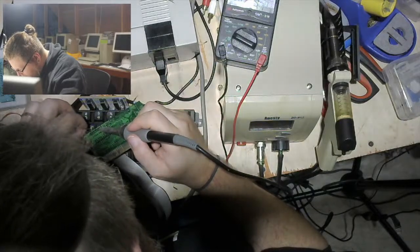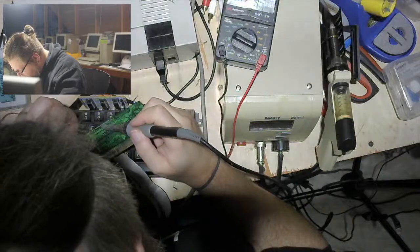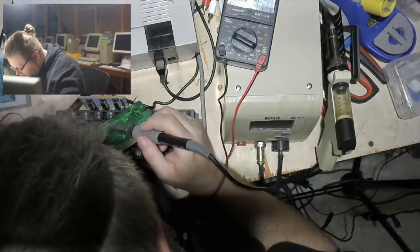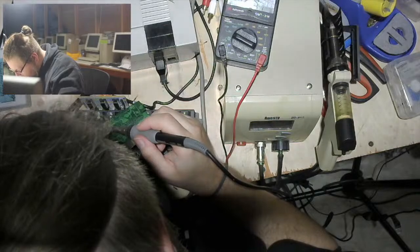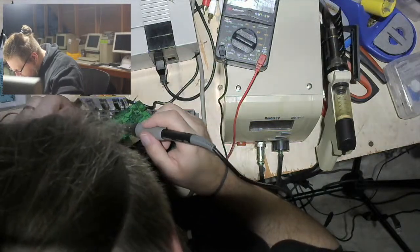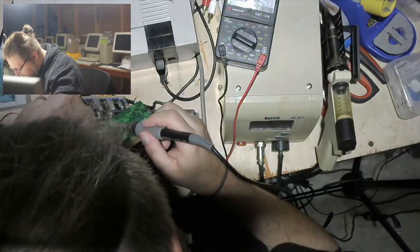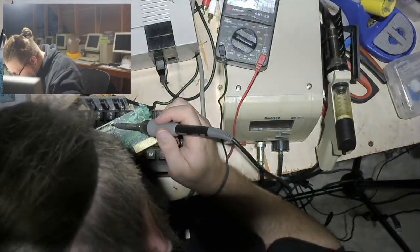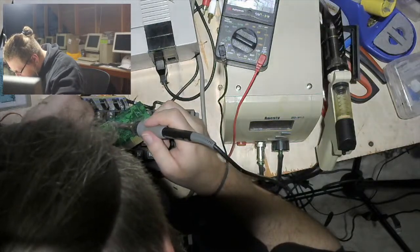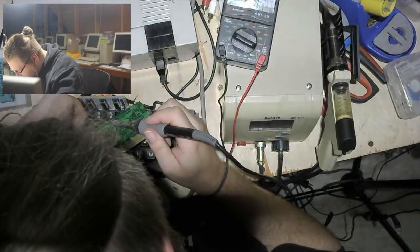And then Wareworm, can you tell me, do I have any more unused wires on the cable? Because you were the one who said, use the unused wires. Why are you even running those things over to the board? And I use the no connect. It's a no connect on the EEPROM, and 5 volts on the mask ROM, and I was running a wire anyway. So I hijacked that one for the read-write signal.